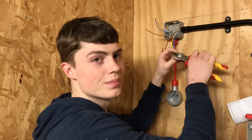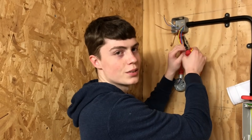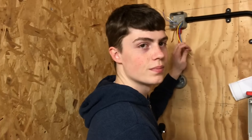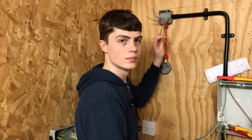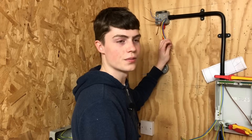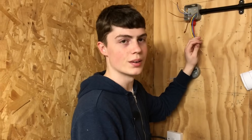So here I am with Tom. Connected to your fuse connection unit and I can see you've wired your socket circuit. Just confirm what size cable you wired that socket circuit in, please. Using 2.5 millimetres squared. What size is the CPC though? It's also 2.5 millimetres squared — because it's obviously in conduit and singles. Which ring final circuit are we trying to mimic here? It's A1. The awarding body asked us to mimic the principles of an A1 ring final circuit. We did have one additional socket from the ring — what did we call it? It's a spur. And if I had three sockets on a ring final circuit, how many spurred sockets can I have off it? Three. What size will the breaker be when we connect up the consumer unit? 32 amp. And what type? Type B. Will it need any additional protection? Yes. What device will offer that? An RCD. And how many milliamps must the RCD be rated at or below to offer additional protection? 30 milliamps. Great answer — carry on, champ.